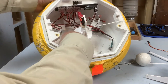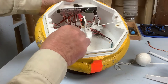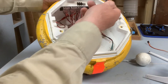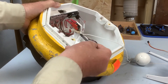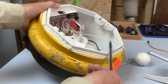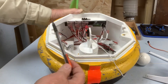Inside, in the center, we've added a piece of tubing — I think it's two and a half inch drain pipe tubing. I've put a wooden plug in the top of it, and there's a bit of a barrel pen put through to lift it up well above the water line, where the actual winch line comes through. There's another small bracket that holds a toothpick or skewer — a little bit of wood — which comes through, and when the mark is up in its place this moves up and switches off the micro switch, which takes the power off the winch.